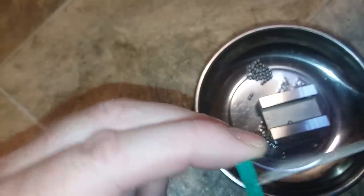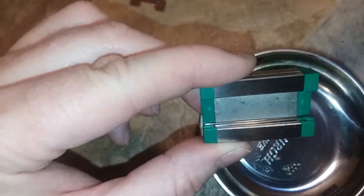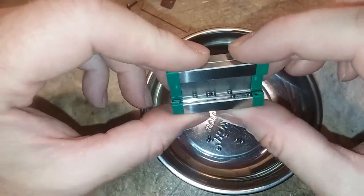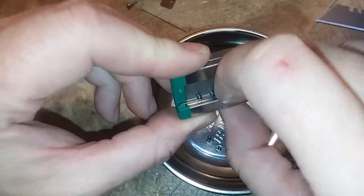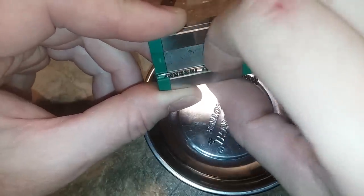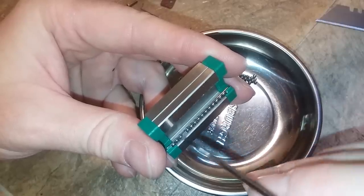Just a few swipes with the diamond file and the little rims come off — same thing on the other side, just filing the extra plastic left over from the casting. Now I've got it back together; I filed down the little tabs left over from the molding process and this isn't bowed out as much. The easiest way to put the bearings back in is to pick them up with your fingers, put them in behind the guard, then pop them in and push them to the side. There should be 33 bearings per side — if you lose one you're kind of screwed. Make sure they go both directions without binding.